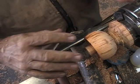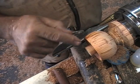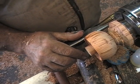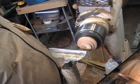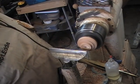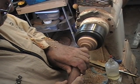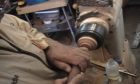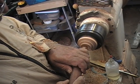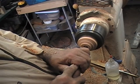I can't finish the piece the way it's sitting, so we're going to take it off the lathe, create a jam chuck to hold this, and then finish the very cap of it. I parted it off. I left it a little bit heavy up there because I want to have a little something I can trim. I'm going to clean this up. If I still had my Forstner bit chucked up, I could do the depression really quick.